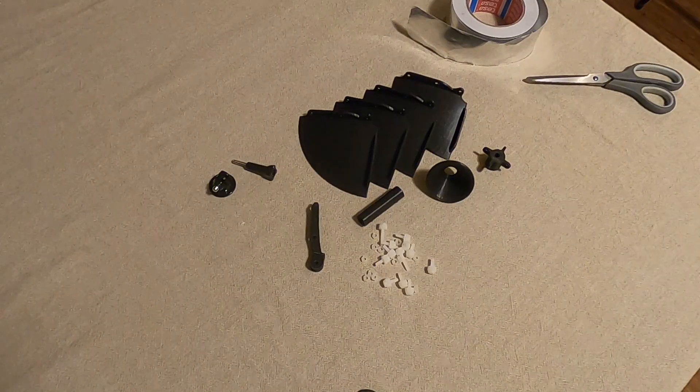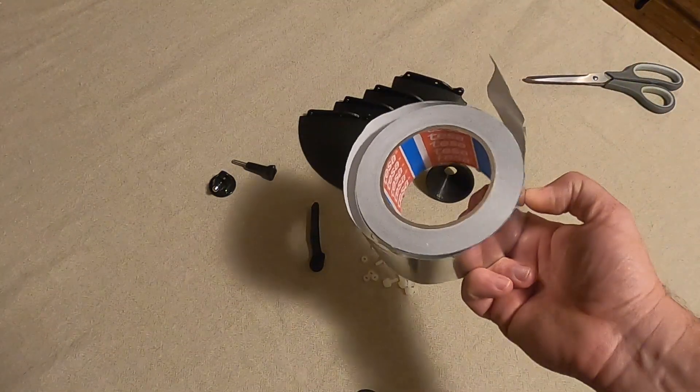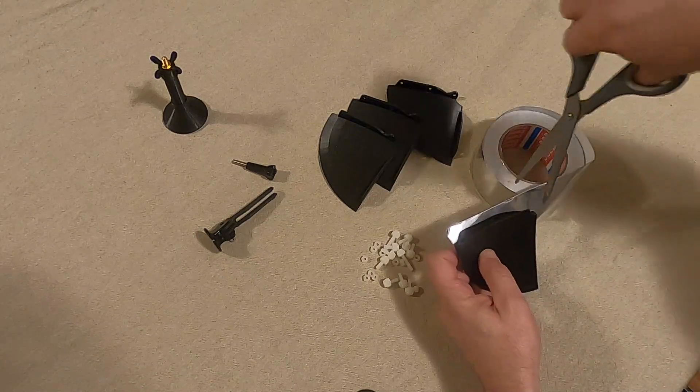Following that, the next step was putting all my 3D bits and pieces together. One key question I had to study for this specific antenna is how to metallize it. Metallize means having a reflector - but when you print using classic PLA plastic, it's not going to reflect anything. I'm doing a study on what you can spray on plastic to make it metal. There are very expensive and very cheap options. For this one I just used normal aluminium tape from the local hardware store.